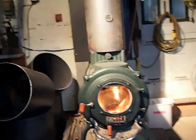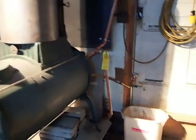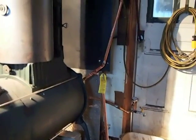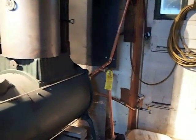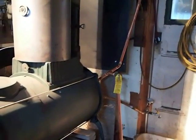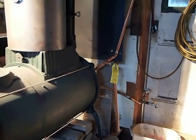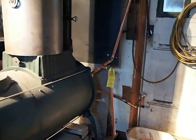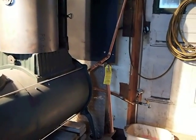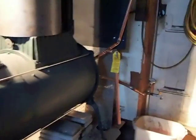Basically, this is not a do-it-yourself system unless you are trained as a plumber and also trained to work with these closed systems — that's what this is called, a closed system. It's not connected to the water system from the house. If you should have a leak and it runs low on water, you have to pull the plug at the top of the tank and refill it, otherwise it will develop an airlock, which I've seen happen a couple of times.